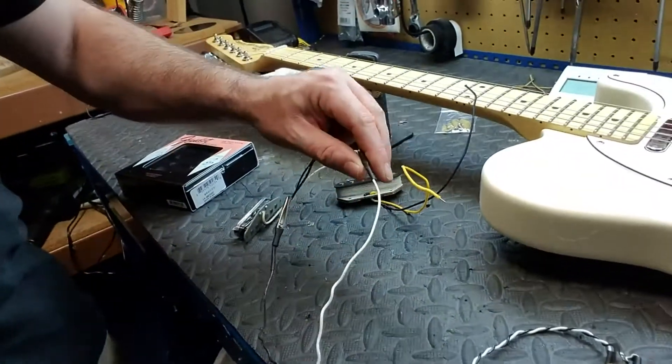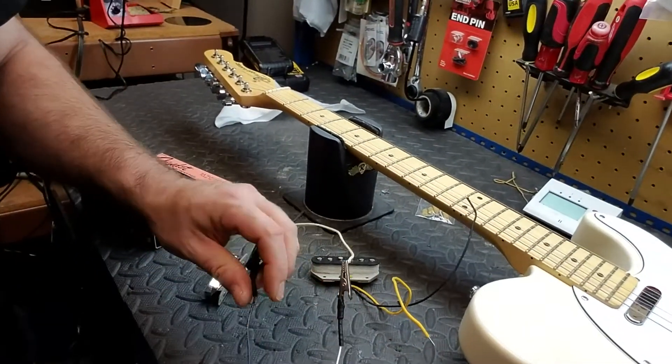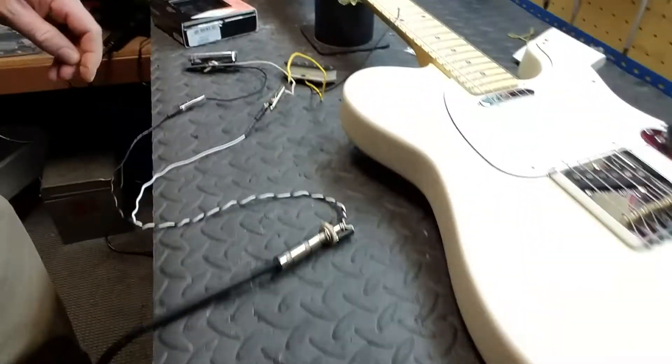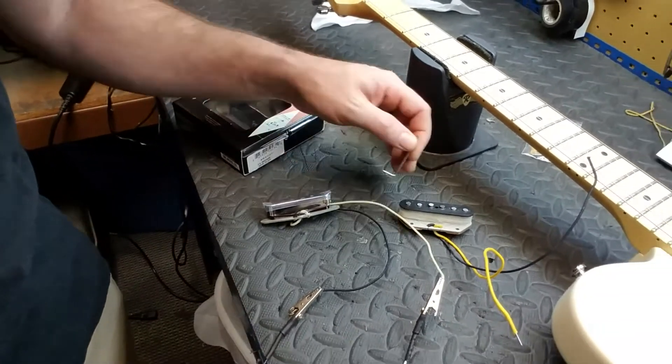I actually think of it as the signal wire or the hot wire, as some people will call it. I've got the typical color coding on my wires to my test jack: white for the signal or positive, and black for the ground or negative. Then all you need is a small, very blunt piece of metal and you should get a nice clear tap test out of your pickups. If you've ever made the mistake of putting in a pickup that doesn't work exactly right, you'll learn the value of having a little test jack like that. It's also very handy for troubleshooting inside the guitar where you don't know why the signal's not getting to the jack — you can just take your test jack and hook it straight up to each possible point in the signal chain to try to eliminate things that way.